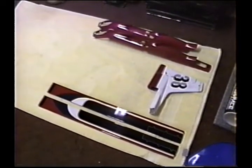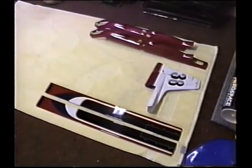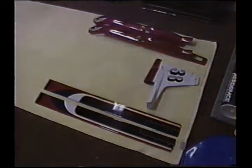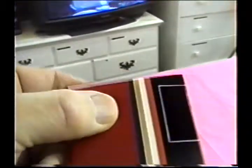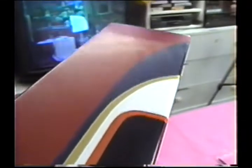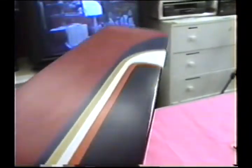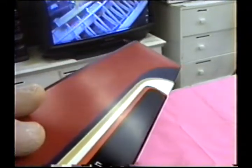Lay out the parts that are finished. Look carefully to see if you're getting any sanding scratches. So far no buffing scratches. If you did have scratches, it means you've got to re-sand with 1200 and then re-buff. Even 1200 leaves scratches but they come out with the compound. If you use 800 or 600, the scratches don't seem to come out as quickly.